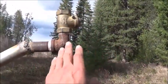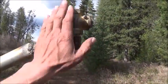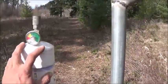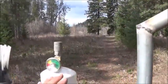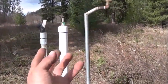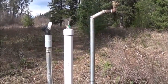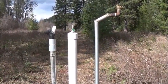One of the additional things we're going to do, once I get a couple more one-way valves, is extend out right here and put a full water ram on it — another tank off a T going up. We'll put the water output there, extend to another one-way valve just like in the water ram video, so we can get both compressed air and pumped water out of this system. Right now I just wanted to check how much pressure I can generate with the water ram effect incorporated into the Tromp design, but in the end we can use this as both designs at once.